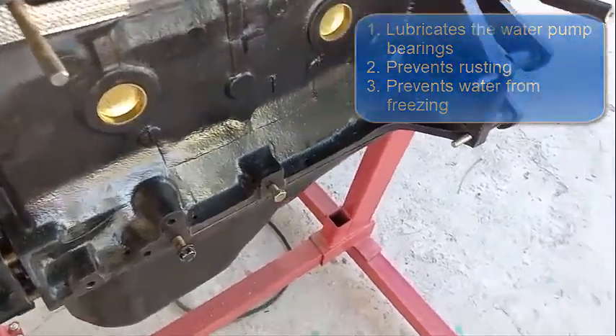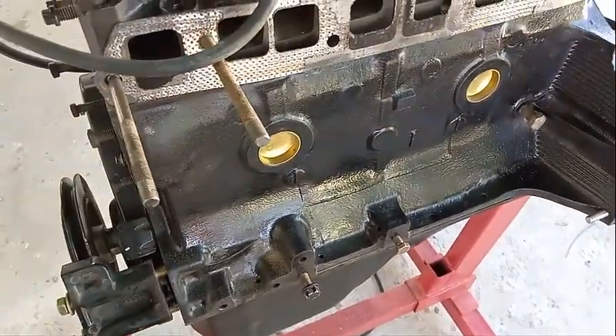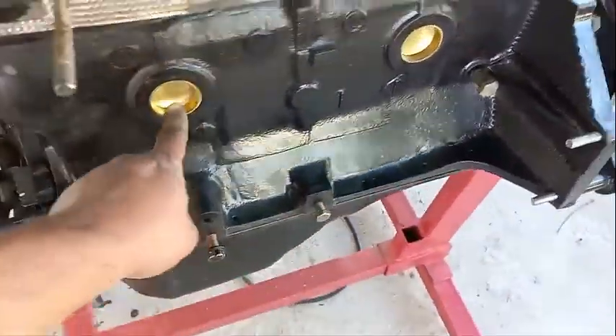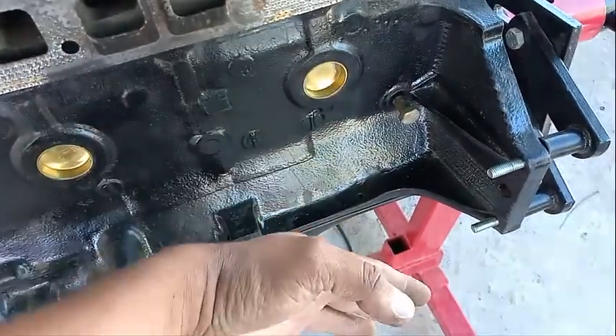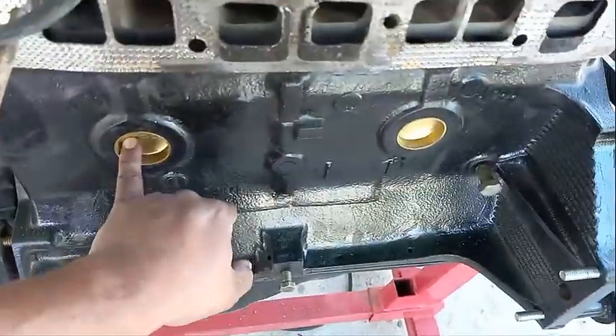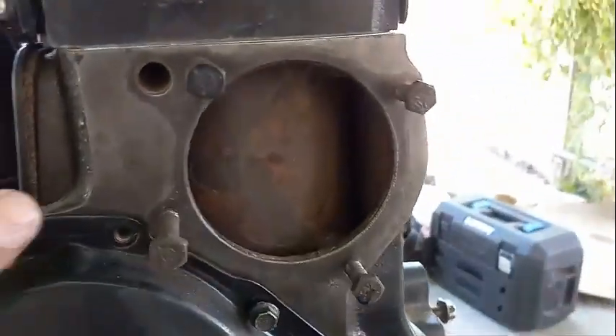If it's winter and you forgot to winterize your boat, the water inside is going to become ice. These brass plugs are actually made to sacrifice: as soon as the water starts freezing, the expanding ice pops these plugs out instead of cracking the block. They follow the water jacket path — if you follow along you'd actually run into those freeze plugs right there.